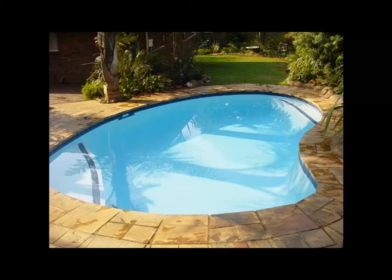The question of course is how to resolve this problem. On some swimming pools you might find that the damp spots are quite visible before you start to paint the pool. In other cases like this one it might be hidden, but by cutting open a few inspection holes you can determine from which side the problem exists.